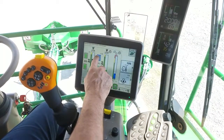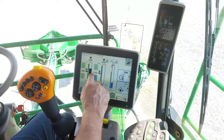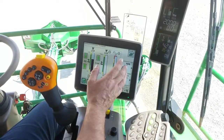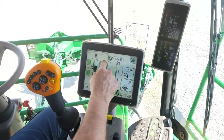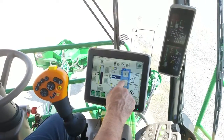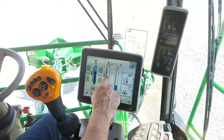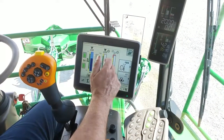If I'm cutting at 1200, at what point would I normally reach over and make a lift because I'm digging too deep? The Delta between 1200 and the top number is your adjustment from where you're running normal to actually making a lift. You can hit your bar graph and adjust that. Right now, 400 above my target I will make a lift. You can adjust this to 300 or 200 above, and it has a lot to do with whether you're bucking the cane or in down cane — sometimes you run the window closer or further apart.